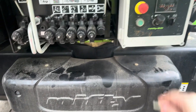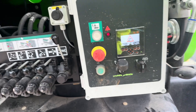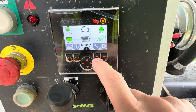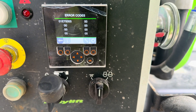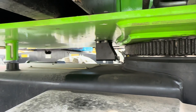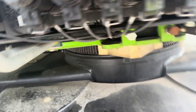We have this machine here with some errors. Let's see what error codes we get — I haven't tried it yet. We see the X in the top right corner so we know errors are present. Oh-one-E7 — O1E7 normally is linked to the slew center switch, which is right there. So something is not right with that switch, and I will have a look into it.